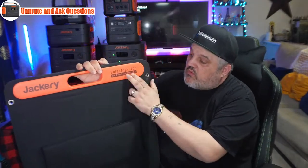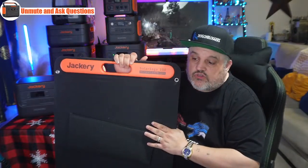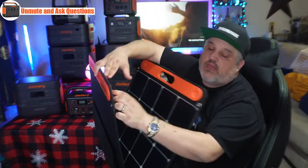Now, we're going to move over to the solar panels tonight. We're going to start this off with the 100 panel. I did show you guys the 100 panel a little bit ago, but I will show you more in depth with this. Now, this is the Jackery Explorer SolarSaga 100. This is a 100-watt panel, 18 volts charging capability, and it does have this kickstand right here that Velcros on and folds out. You should be able to set this solar panel up in under 30 seconds. Now, it's got earth magnets in it that actually keep it closed. If you guys can kind of see right here, this little round ring is an inlet that's going to connect to the opposite side ring that's going to magnetically stick closed.